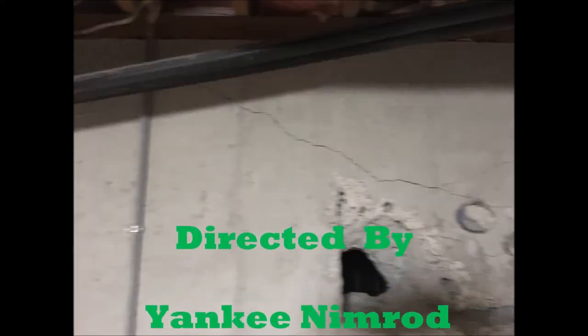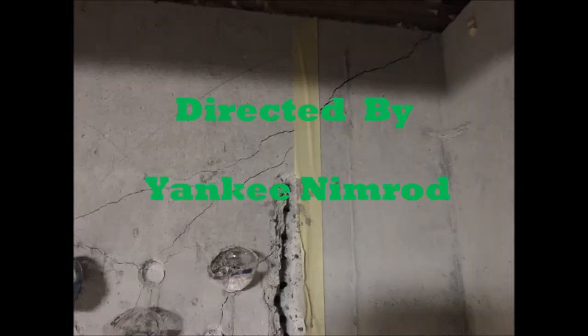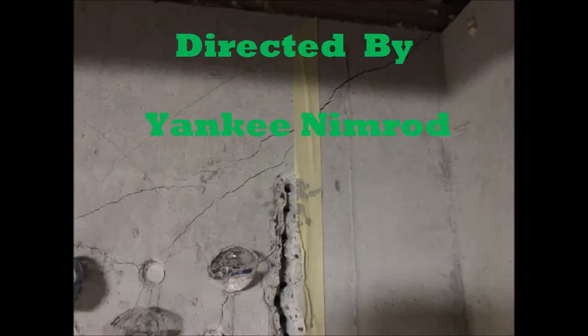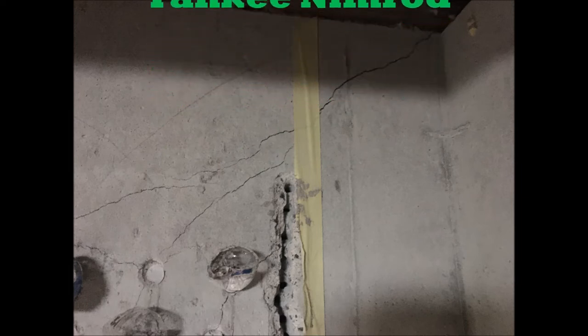It only took a few minutes to knock the blocks apart. This picture is at 24 hours, and the next picture is 48 hours at the same spot — and it keeps expanding. Definitely wait 48 hours if you can because it expands more. In fact, it expanded too much. I thought it was going to break off at the line of holes I drilled on the side, and it didn't — it went right up to the top of the foundation.